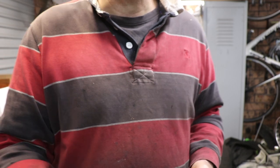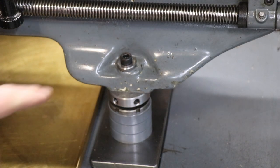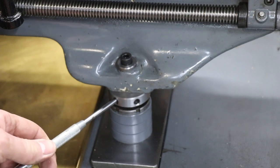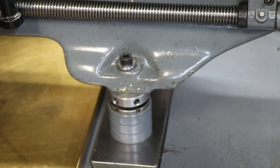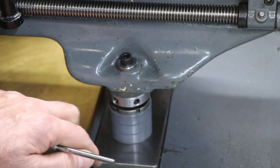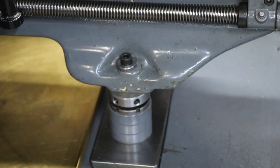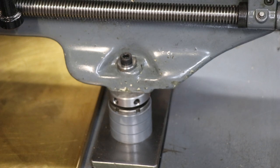So I thought I'd make something that was basically a machinist's jack. Now let's get a better look at them. Here they are in close up. It's got a cap screw in the top which bolts down to this top section, which is threaded, and there are holes there so you can put a pin in and finally adjust it. There's a lock collar here, a nut which locks the thread, and this base is bolted down to this thick plate. So it allows me to adjust the feet to be level, and there's quite a fine thread on that threaded section, so it allows quite fine control.